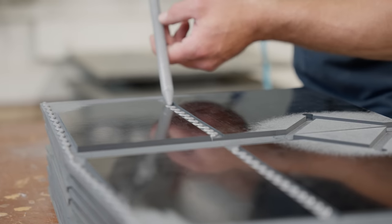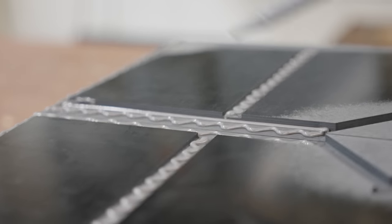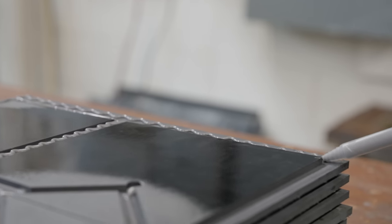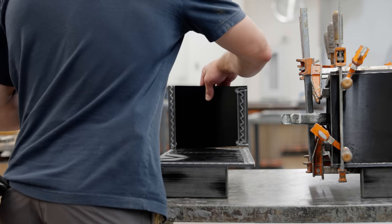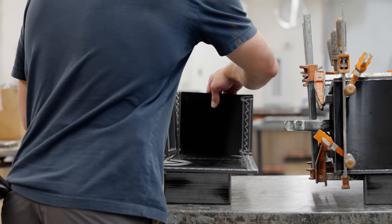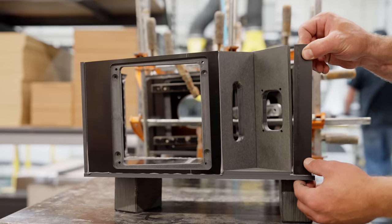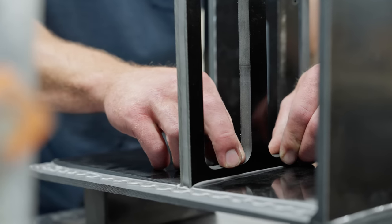After the milling process has occurred, the craftspeople prep parts — they take the necessary adhesive, line up the parts, apply the adhesive, and use clamps and jigs to assemble the speaker. Now it's taking shape, moving from two-dimensional pieces to a 3D shape. You'll see there's some glue squish, and that's intentional — it's to ensure that it's airtight and accounts for any shrink back that may occur.